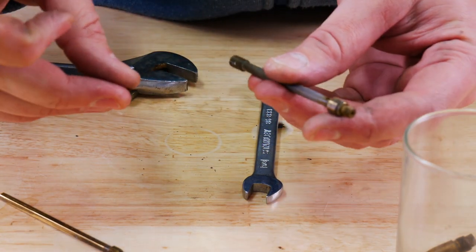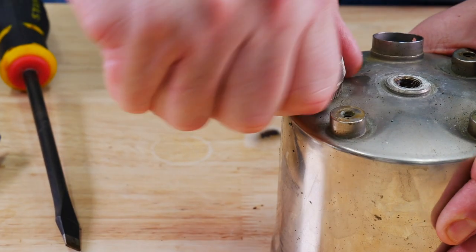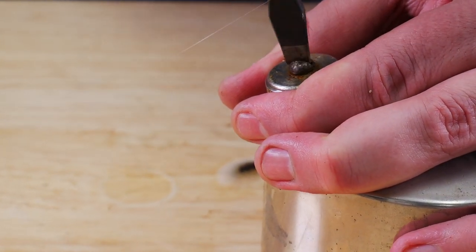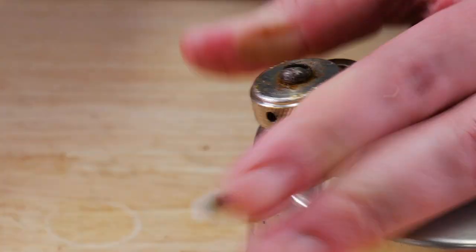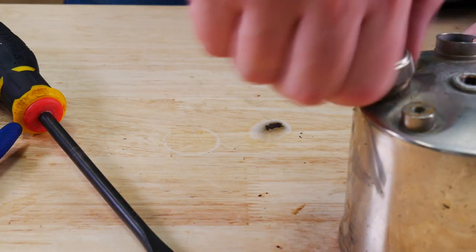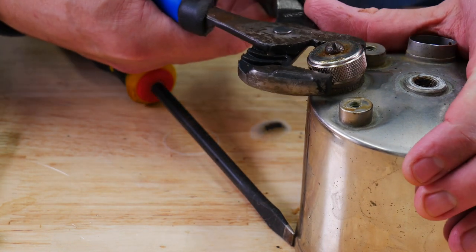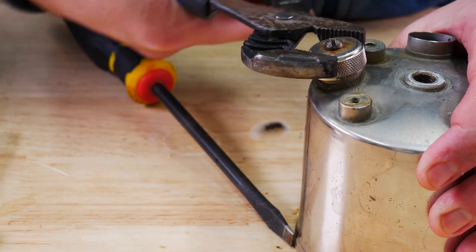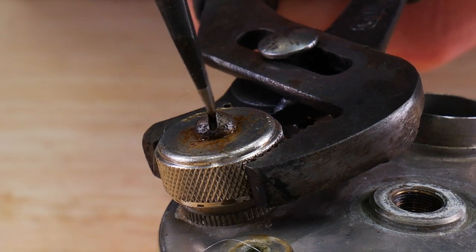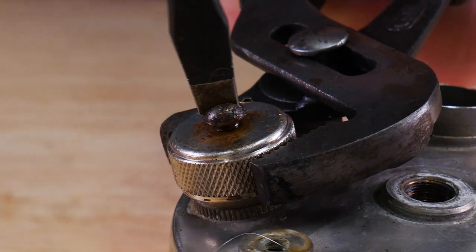Here I'm just making sure that the hole in the pickup tube is open before I put things into the ultrasonic cleaner. Now a little tip: if you want to get this three-piece cap apart and it's pretty rusty — as you can see, it is very hard to get it to stop spinning. So you can try some kind of a contraption, or just tighten it really down. I even got some pliers and tightened it down. This took about 15 minutes — it looks really easy but it was a solid 15 minutes — and I got it out. Very rusty screw. Yes, I was very pleased.